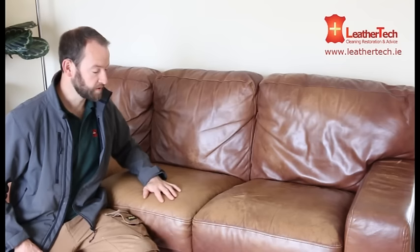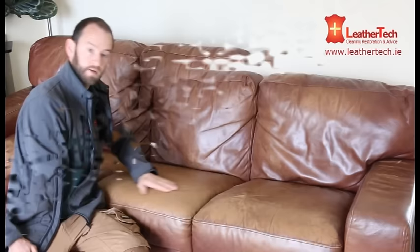Hi, I'm Ross Hennessy from LeatherTech and today I'm going to restore this leather couch here. What's happened is that the top coat has come off this brown two-coat leather suite of furniture. What we're going to do is clean it back, make sure all the grease, oil, dirt and all that is removed from the leather surface. Then mix up a colour to match the original colour along where it hasn't been worn, reapply that, seal it in with a finish, match up the sheen, apply a protector and you've got a whole new surface on your couch. It's the same process used in factories for colouring leather, so it's a very permanent type of fix. I'm just going to show you through the steps.